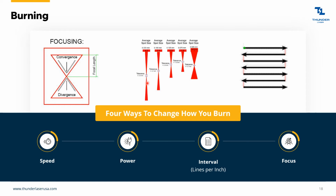And then actually with the 4-inch lens, you can engrave faster because it's a bigger spot size, and so you can increase this line interval, and you can actually engrave faster. So once you get better, if your engravings aren't very detailed, you can engrave with the 4-inch lens and increase this line interval, and then you don't have to make so many passes, and it can drastically speed up your engraving time.